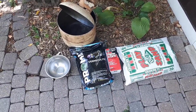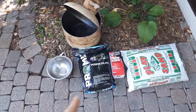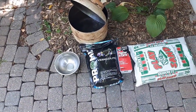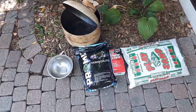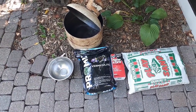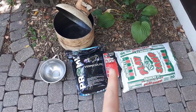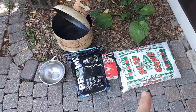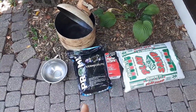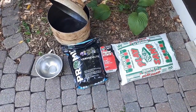So what I'm going to try today is using plaster of Paris, sand, and vermiculite. I kind of wanted to use perlite, but it seems to be sold out all over the city. I guess it's just the end of the summer and they're not reordering that sort of stuff because people just use it for gardening. But I don't know what mix to use. So I'm going to start off with one part vermiculite, one part plaster of Paris, one part sand. Then I'll try two parts vermiculite and three parts vermiculite, because the more of this stuff I can use, the cheaper it'll be and the lighter it will be as well.